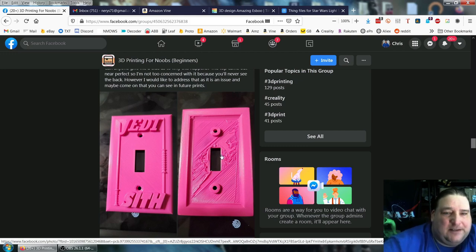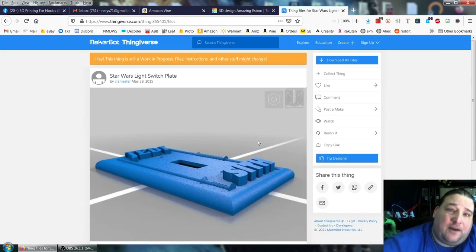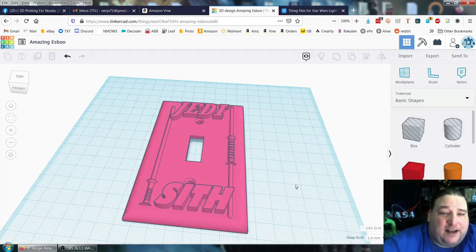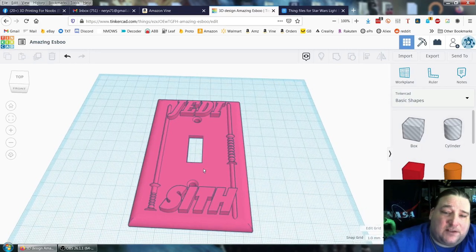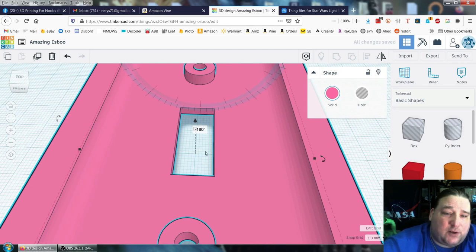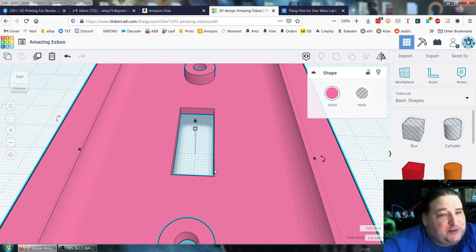The problem is that's a lot of support. In theory you only need support around this hole in the middle, but I'm going to show you a neat little trick. The first thing we're going to do is rotate this 180 degrees. Then we're going to close this hole — fill it in, but only for one layer. The idea is to turn this into a bridging problem instead of a midair printing problem, because bridging is a lot easier to deal with.